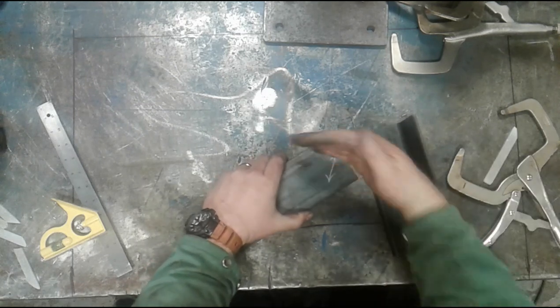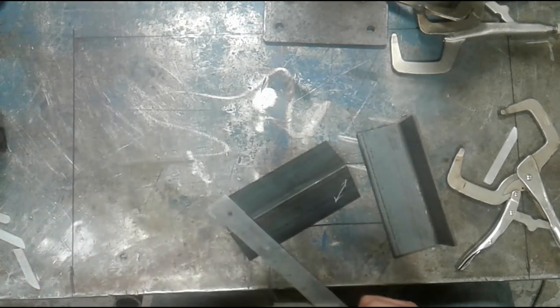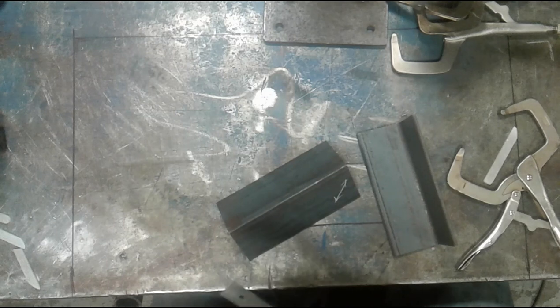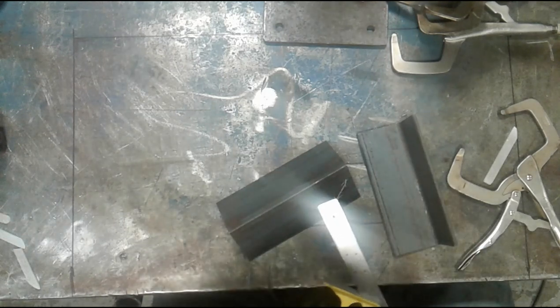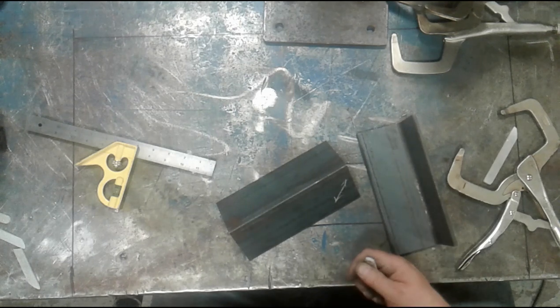I've seen people cut them backwards. I've probably done it myself. I'm just choosing to block it out. But essentially all we really need is a 45 degree angle. Now if you're joining parts together that aren't square, that interior angle will obviously change. But for a straight picture frame join, it's gonna be at a 45.